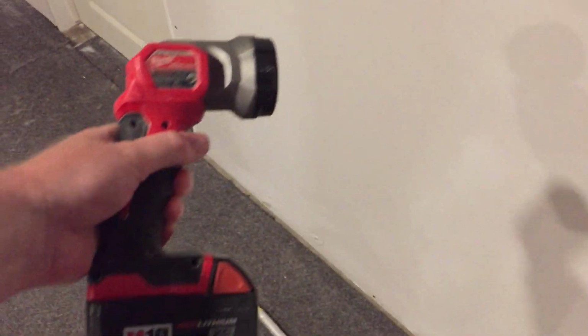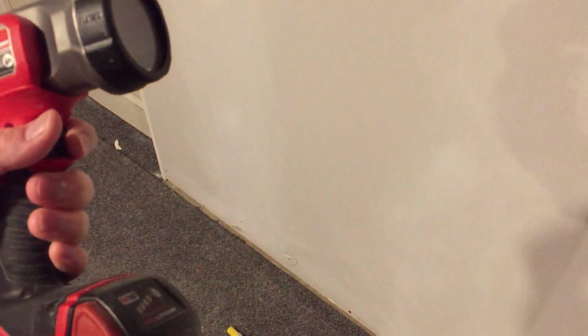And coming over here, well, first of all, sorry, I should say that when I'm sanding, I like to use just a battery operated light like this. A lot of guys don't like using the halogen spotlights. They're really good. The problem is they get very hot, and a lot of times they'll actually be sitting on the floor and they'll be casting light kind of up like that. So it's very inconsistent. You can see that right in this area it's very bright. Up here near the top, not so much.